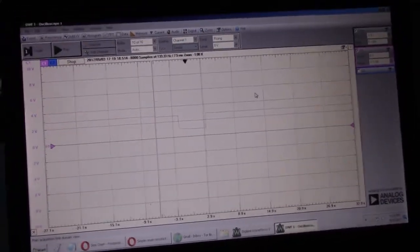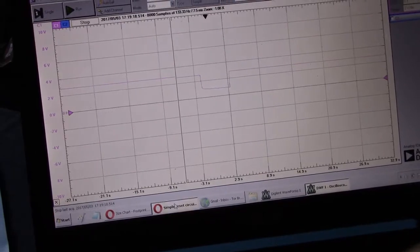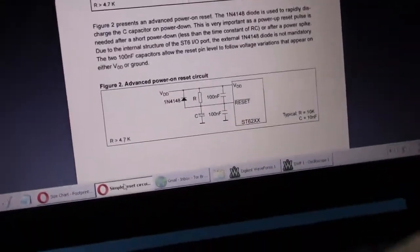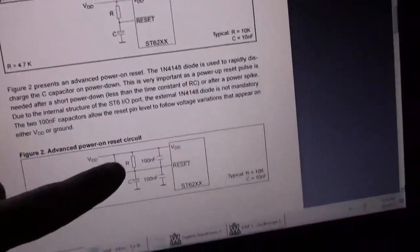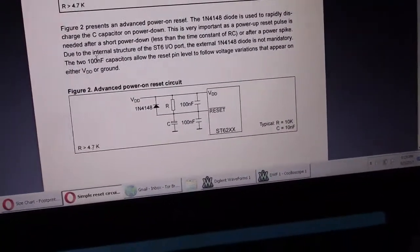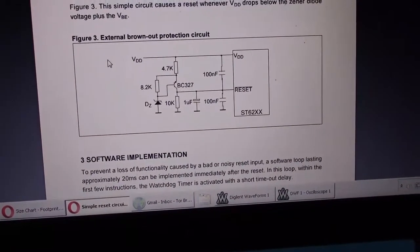And so I left off saying that there were some other ways, other than these traditional textbook circuits, for fixing my power on reset issue, and hopefully yours. The two textbook methods we have here are an RC network and an RC network with a diode. Now, there is a third that they also talk about, which is using a transistor